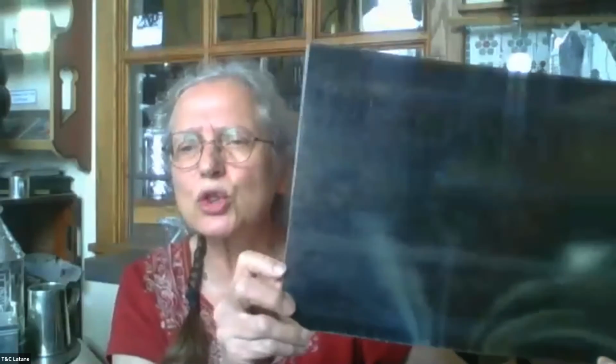This is a sheet of tin plate. A tin plate is a product of the Industrial Revolution, a thin sheet of iron, or modern it's steel rather than iron, that's dipped in tin. Because the iron was so thin, it would be very vulnerable to rust, but the tin plating on the outside protects it. It's very pliable, it's so thin, and because it's got the tin plating, it can be used for all sorts of food products, and it doesn't impart any taste to the food. And for lighting, it reflects and adds to the light.